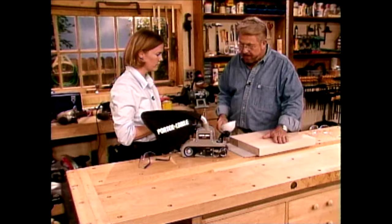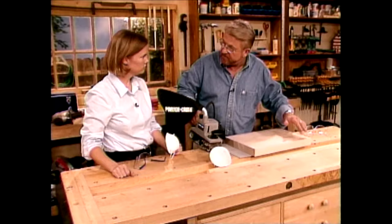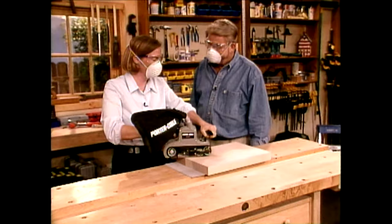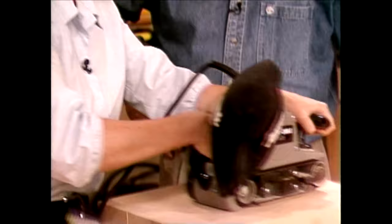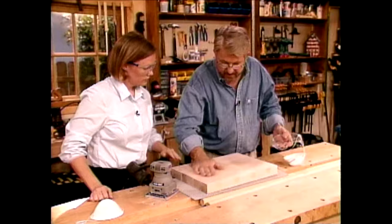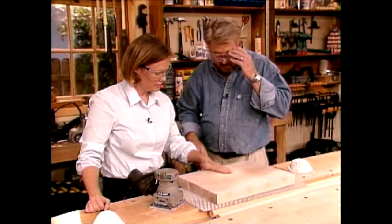Now I want to take a little bit of time to sand this. This is a belt sander. We're going to sand at a diagonal to the grain to flatten each board relative to the next, and then go with the grain back and forth. Emily quickly gets used to the power of the belt sander and smooths out the surfaces. Then she takes a few more passes with a random orbital sander and progressively finer grades of sandpaper. Feel that — it's glass smooth. By using progressively finer sandpapers, we get rid of all those marks.